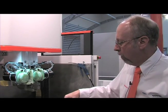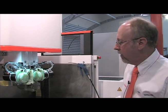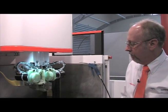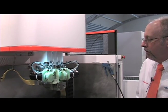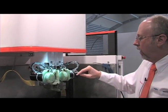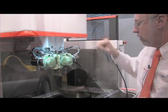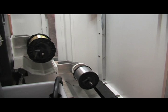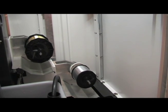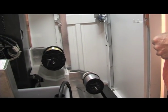Right now we're using one diameter wire, and through the v-guide system on this machine tool it has open v-guides. We'll go ahead and it will cut this wire. Here we can see the wire being cut and it's disappearing. Then what happens is that the brake mechanism, which is pretty much an integral component of the wire spool in the back of the machine, will move away. The next brake component will come in and a new diameter wire or a new type of wire will go ahead and thread itself into the workpiece, into the lower guide system.